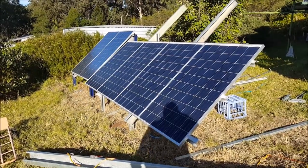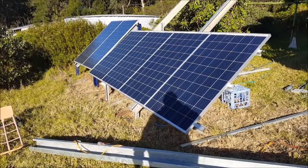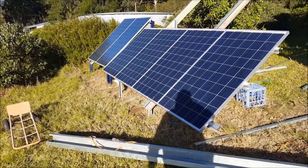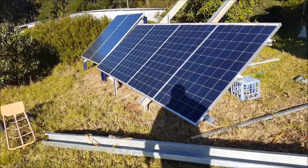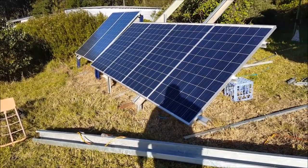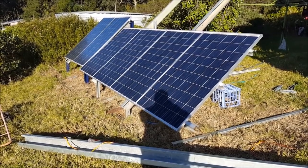Anyway, thanks for watching. Hope you enjoyed this video. This steel is a pleasure to work with — very forgiving of mistakes. And these panels were actually a lot easier to get on there than I originally thought. I'm working on my own here. I just used a couple of F clamps — clipped one corner on, got it all nice and level and square, clipped another corner, and then went and tech screwed the rest. So thanks for watching, and I'll talk to you in another video.